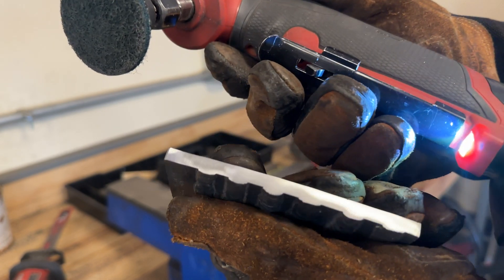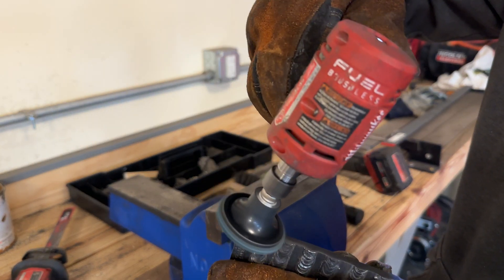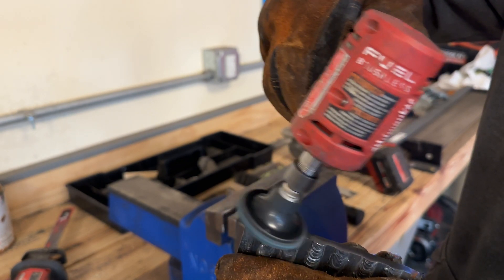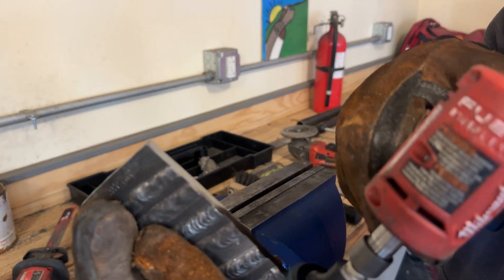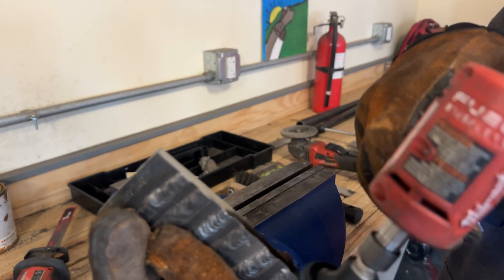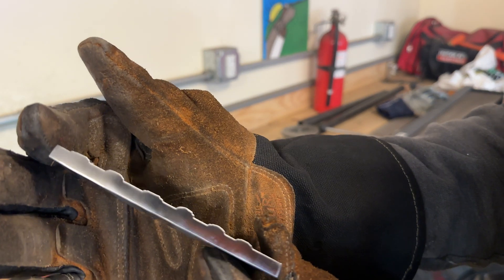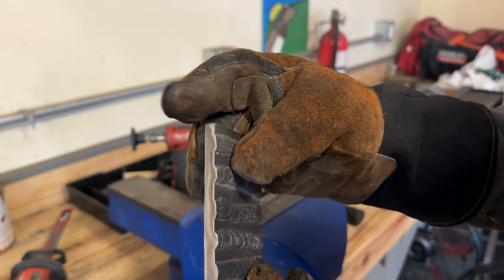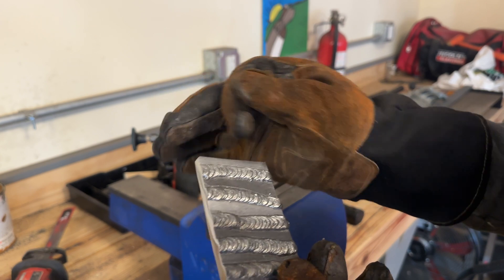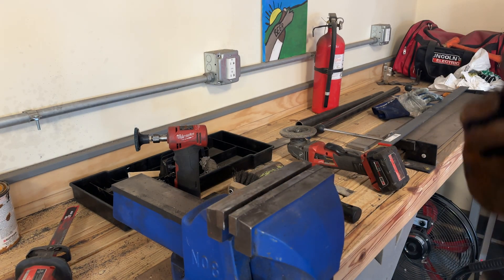See how that's much shinier and polished? I'm using the light from overhead to get an idea of how polished it is — I'm not running this thing wide open; you don't want to do that. So that's about as good as it's going to get. One of the benefits with 6010 is it etches really well in this particular steel. With 7018, it can be very difficult to get a solid etch to differentiate weld metal from base metal, but 6010 doesn't seem to have those issues.